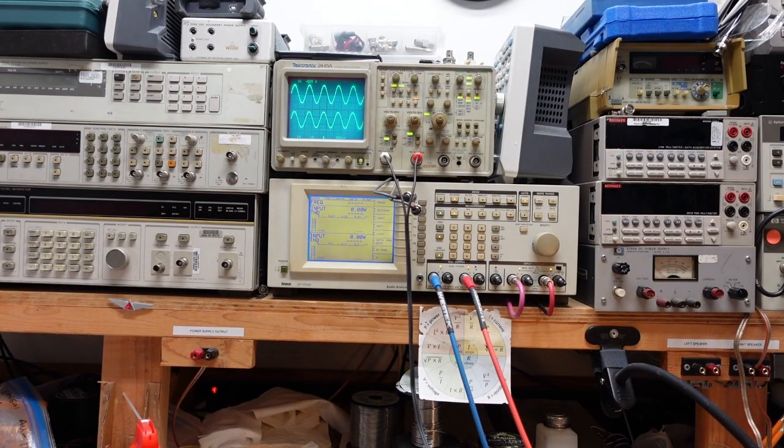Okay, so I'm feeding a signal into the FM. Looks really stable, which it didn't before, so cleaning that function switch may have helped here. The signal is pretty strong, so I expect it to look good. I think there's still a problem in the FM, but I'm not going to tear into anything until I get all these switches cleaned, because I believe we might have a problem with our mono stereo switch here. See, I have nothing coming out. Only in mono do I have something on both channels, and I'm feeding a mono signal in currently.